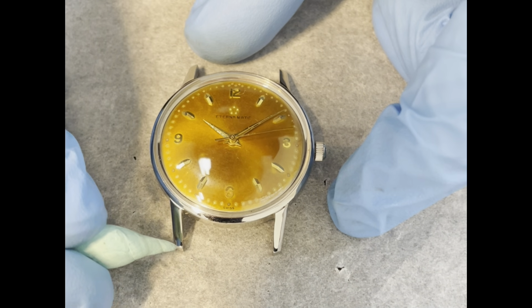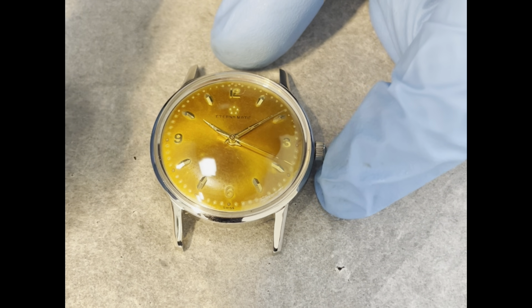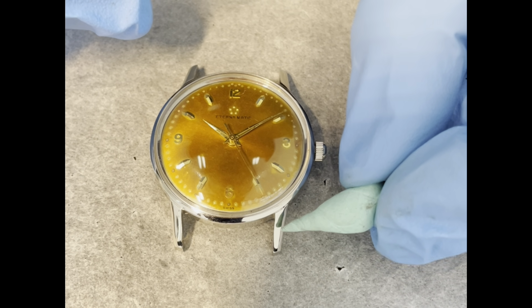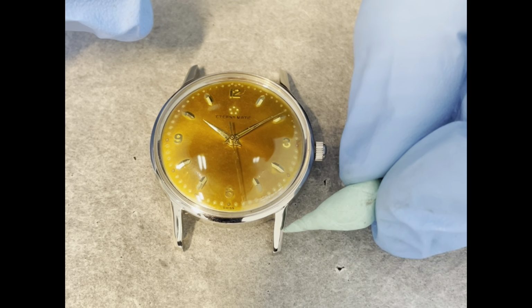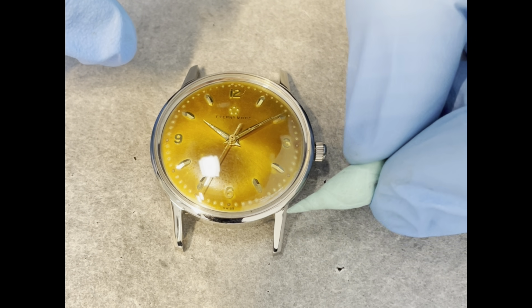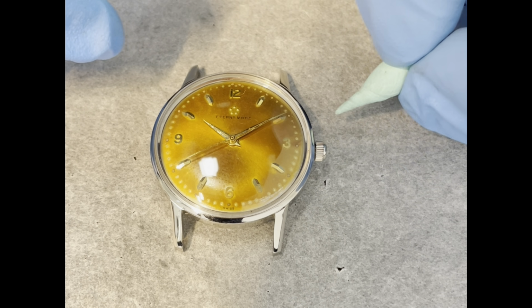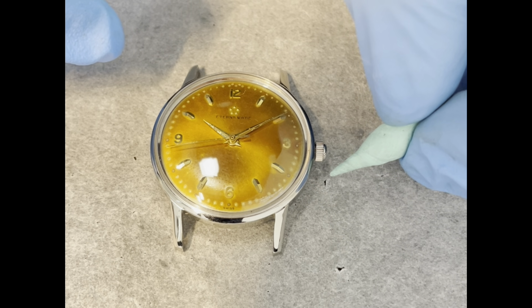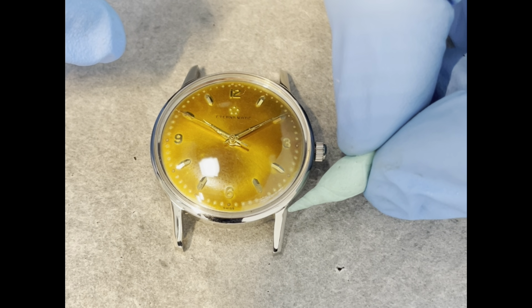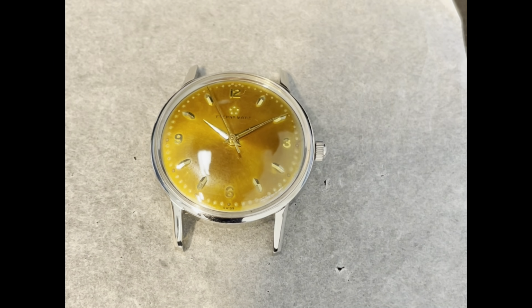There's only so much I could do without cutting away too much material, reshaping it. But the surfaces are fairly straight and they look pretty good. You can even see the light coming off at the different angles. The facet, you have a facet cut in on the side. Again, I would say 85 to 90% there. If you want those super crisp lines, you'll need to get a proper lapping setup, and it's very, very expensive. I'd love to do that, but then again, you've got the challenge of the angle here to here, that if you come this way, it would start cutting into the bezel. So it's all about compromise and how you do it. So I'm fairly happy the way it turned out. But the important thing is we have a wearable watch.